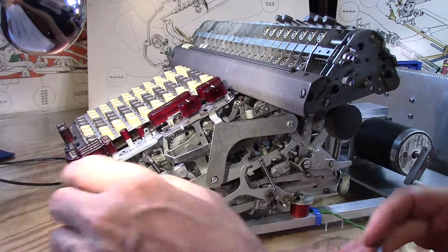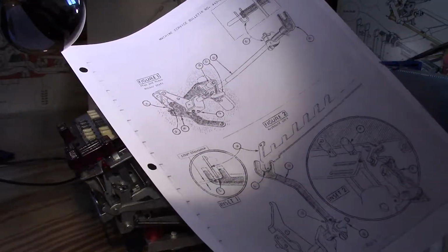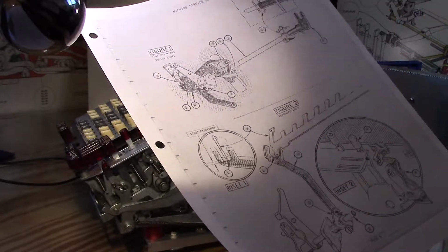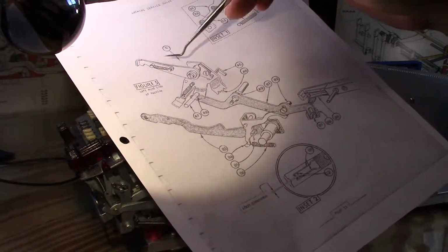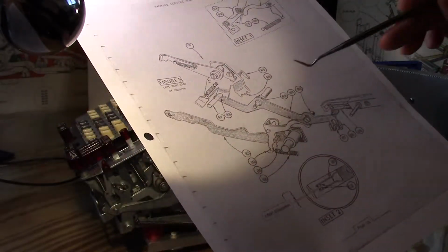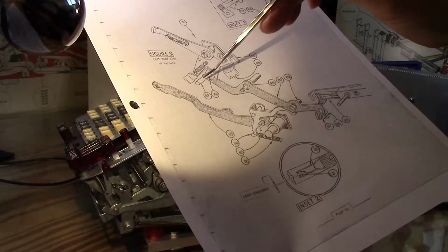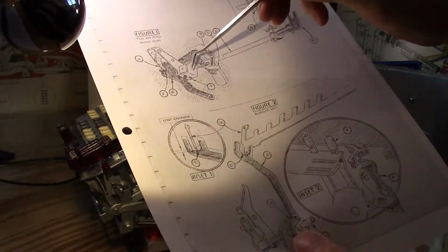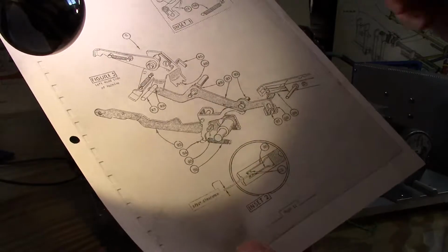So that required, once again, I'll move this carriage out of the way. That's the reason I had to tweak those little screws that adjusted this position, this arm that goes ultimately to the addition and the carriage shifting button, to get the arm clutch mechanism to move over just a little bit further. Otherwise, really early on when I was trying to figure it out, I could hit divide tab and it would go through the initial motions, but it wouldn't quite move unless I nudged this arm over. Since I turned these screws, only about a full turn or maybe two, loosening one, tightening another, I can't remember which, that allowed enough positive motion to allow this pin to go over, and I wouldn't have to nudge it with my finger ever so lightly.